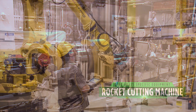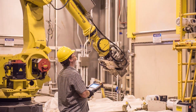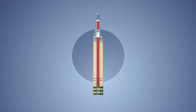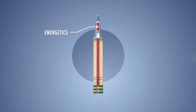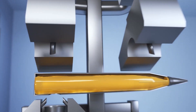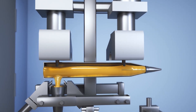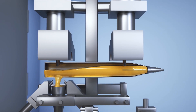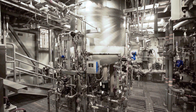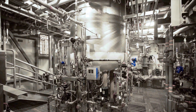From that machine is where we actually separate the warhead from the rocket motor itself. The rocket motor will be sent off to the motor packing room for further storage and processing at a later date. Meanwhile, the warhead containing the energetics or explosives and the chemical agent continues to the explosive containment room, where it will be punched and drained of its agent, and that agent will be sent off to a holding tank.